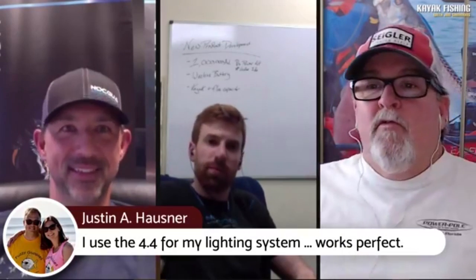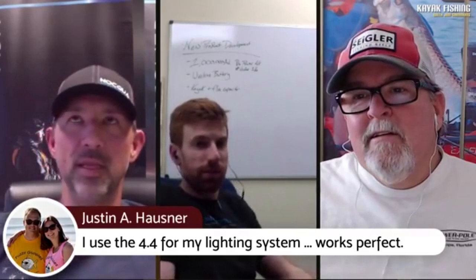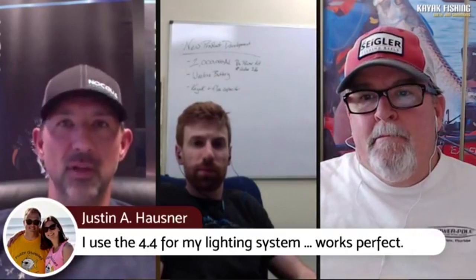The 10 has definitely been outselling the 4.4. Justin says he uses the 4.4 for his lighting system — yeah, those are pretty low draw. When we arrived at 4.4 amp, it was based on the light output — the lumen output from our light bars. We knew if we're going to run 2,000 lumens, we wanted that to last two and a half to maybe three and a half hours. The 4.4 amp was a perfect size battery for that capacity. It just so happened to also be a great application for fish finders. But with the 10, it's just nice — you have quite a bit of backup, and when you're running with a splitter or Y connector and charging your GoPro or phone at the same time, you have plenty of juice to be out there all day.